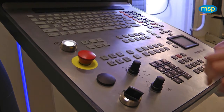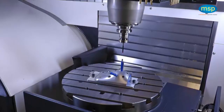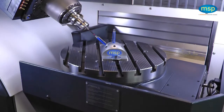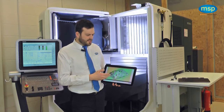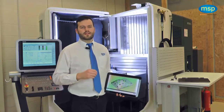The operator would now run the normal machining program with the corrected alignment. Today our demo machine is not being used for cutting, so to prove the alignment we will run a secondary probing program. As you can see, the pens and the probe are now in alignment. As we expected, the NC Perfect Parts software has successfully aligned the part and removed the manual setup error. This can be seen by the secondary probing program measuring the part correctly. The machining program would have also created a perfect part.